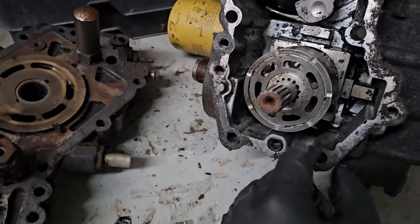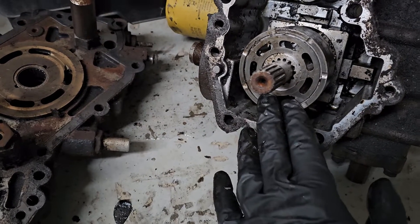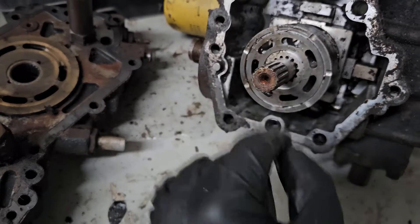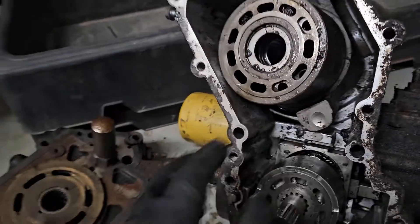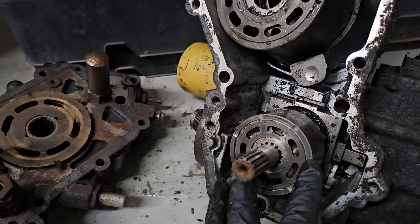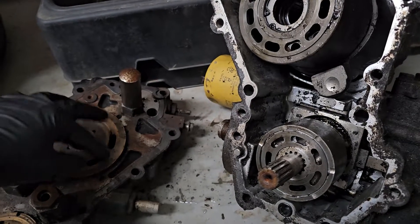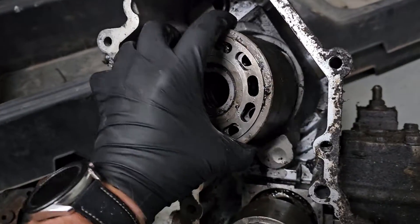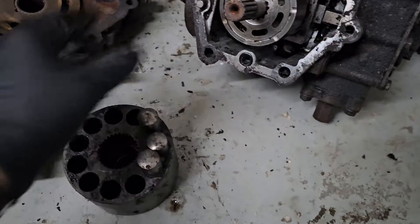That's all that's doing, and then that is going to send pressure. The reason it can go forward or backwards: if it's on the top, it's sucking in this way and pushing it out that way. But if it goes backwards, it's sucking it in this way and pushing it out that way. That goes through this chase into here and then up to the motor, which is exactly the opposite of this. So now this charge pressure from the pump is going through this plate up to the motor, coming in this side or out that side. The motor looks exactly the same, but this motor is bigger - much bigger than the pump side.